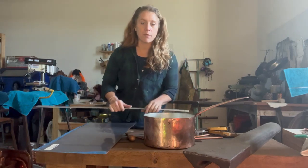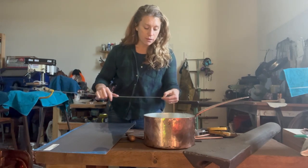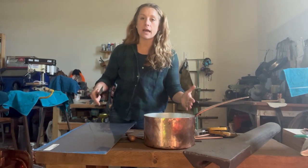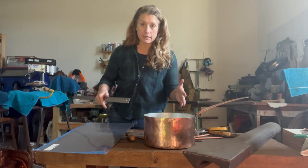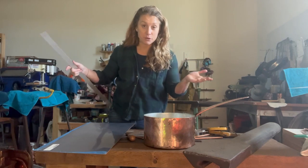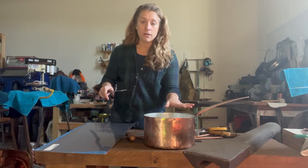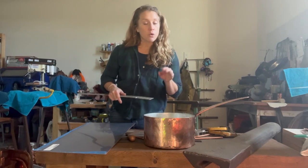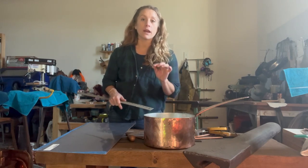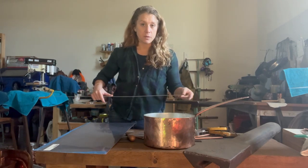My general rule of thumb for making a lollipop lid is that you want about an eighth of an inch hanging over the full diameter of your pot. You have to add that to both sides of your radius. So in this case, a 9 1/4 diameter for what I'm measuring means that I'm going to cut this circle 9 1/2, which will allow for an eighth inch overhang around the entire diameter when I have the finished piece.